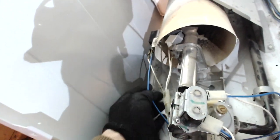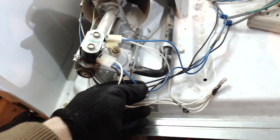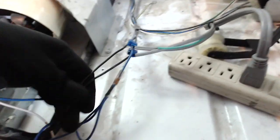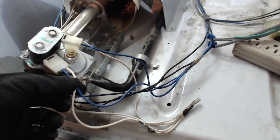The light blue wire is L1 and it goes up to the main coil right here. It also goes to the flame sensor, and also goes to the hold coil right here. The blacks are the neutral — they're connected up there and they will go to the hold and assist coil right here, and also to the igniter. See the black wire there? That's for the igniter. So really, even though there's a mess of wires, they're all tied together.